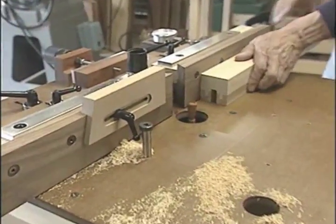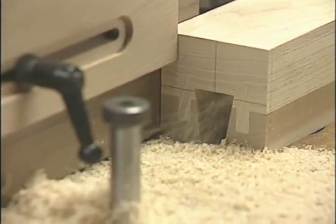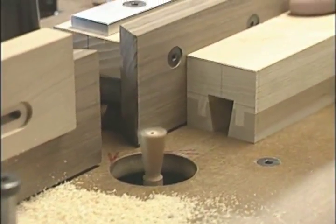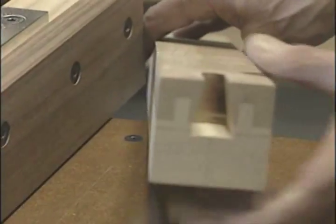If you're careful and don't move anything, the dovetail path will be right down the center of the straight bit cut. This is still a substantial cut, so hang on to the work. That much racket signifies cutter overload, but there ain't much you can do about it. To be sure, dovetail bits are inherently weak and they push the limits of strength possible in a bit.